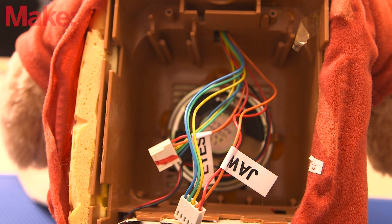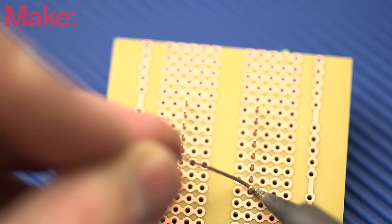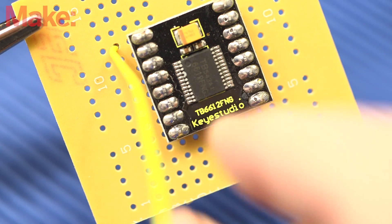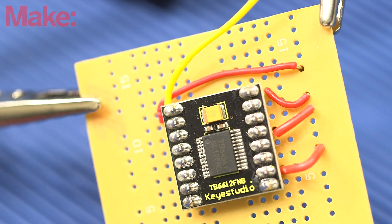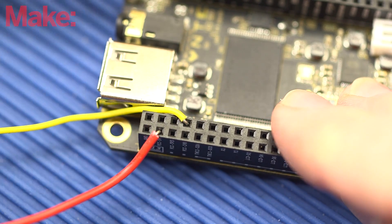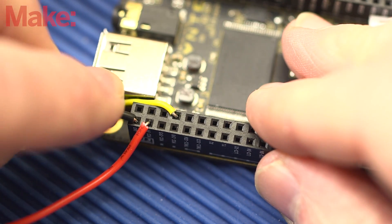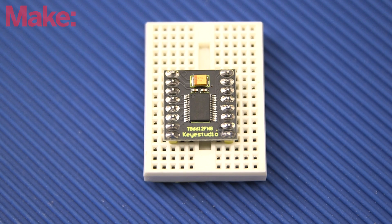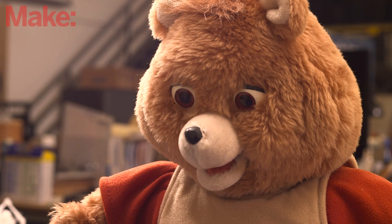Because we need to control the motors and drive them in both directions, we'll install an H-bridge. Solder the H-bridge to a piece of perfboard and connect the VM pin on the bridge to the BAT pin on Chip. Continue by connecting VCC, PWMA, STBY, and PWMB to Chip's 5V VCC line to power all of the motors. Then ground all connections from the H-bridge to the GND pin on Chip. Now connect the I/O signals to tell the motors what direction to move — sending a logic signal to one pin will drive the motor forward, and sending another will reverse it. This controls moving the eyes up and down and opening and closing the mouth.